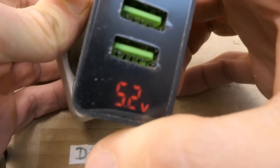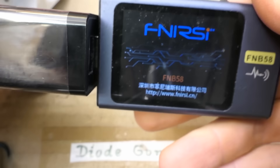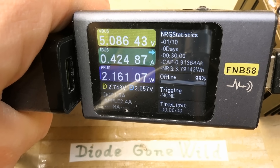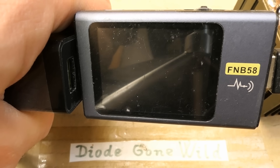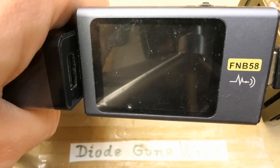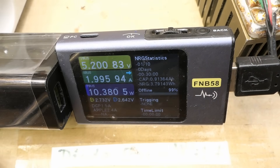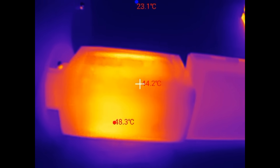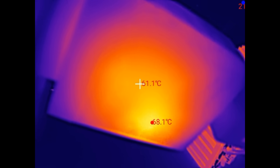Now let's test the next one. Is it another of these with the display on it? Let's explore it — plugging it in. It supplies 5.1 volts. Increasing the load: 1.8 amps, 1.9 amps, 2 amps and it shuts down. Leaving it running near the maximum current — no failure after 8 hours. On the outside it's actually significantly less hot than the other one. The other side is a bit hotter at 68 degrees Celsius.